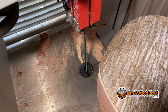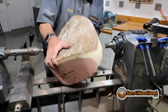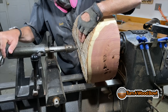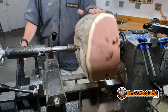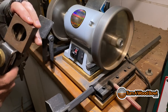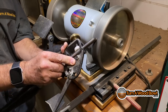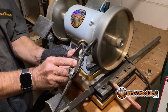Now that we have our cylinder, we'll move over to the lathe. I'm going to mount this between centers. I've got a four-spur drive center that I'll put on the headstock and I'll pull up the tailstock. It's pretty balanced — looking pretty good. You can see those holes on the sides. Before I get started, I'm going to sharpen my bowl gouge. You always want to start with a sharp tool, and I'm going to be sharpening throughout this turning.